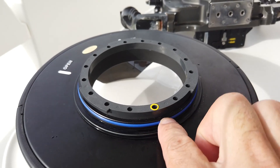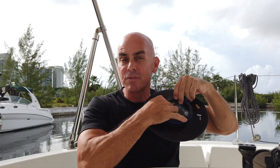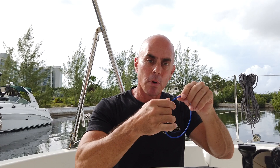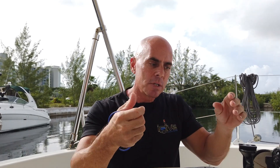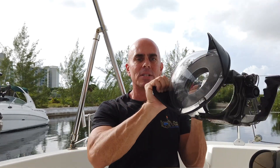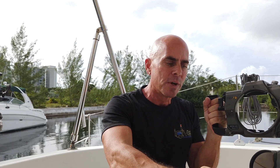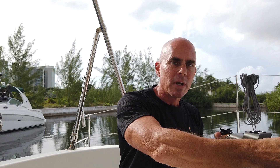You can see here the o-ring is set flush against the port. I'm just going to pull it out — a nice little trick: if you can't get them out, a guitar pick is a good way to pull these o-rings out. The reason I want to lubricate this o-ring is because when I put my port enclosure back together it twists on the o-ring, and if it's not lubricated it could pinch it or even roll it. So I will go ahead and lubricate that o-ring.